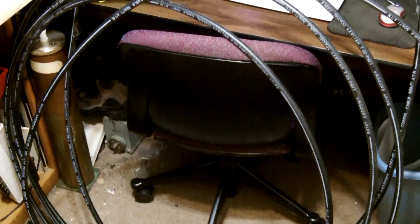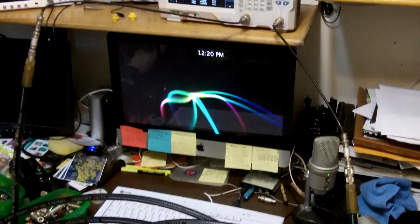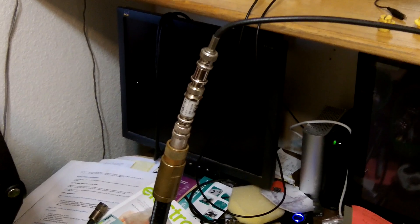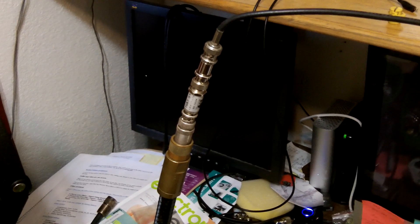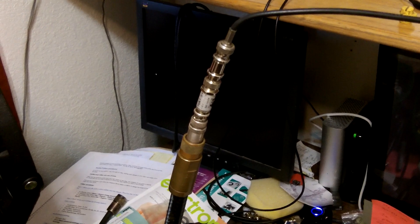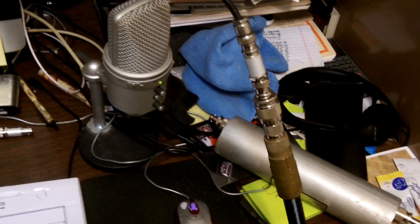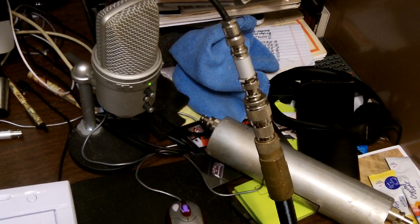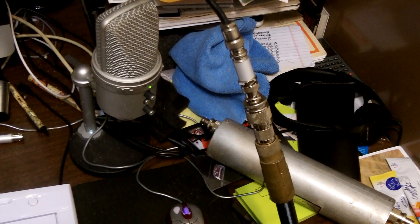I'm going to revisit my cable setup here. This is the Heliax 50-foot piece, and I've got it connected from the output of the tracking generator to the input of the spectrum analyzer through these adapters and attenuators. There's about a 6 dB pad coming off the source and the various adapters to get into the cable. On the receive side of the spectrum analyzer I've used a 3 dB pad, mainly to swamp out any variations caused by these cables and any standing waves. I also normalized the whole thing with all the adapters but without the cable, so the reference would be to only the cable.